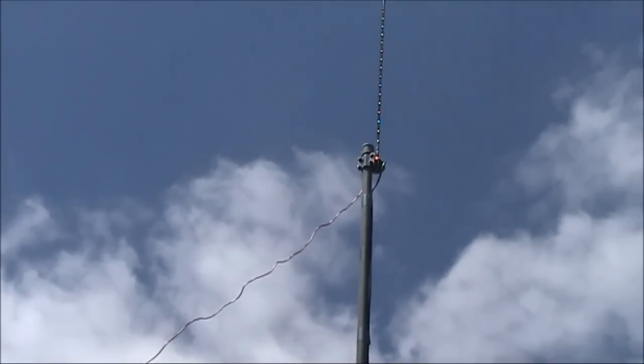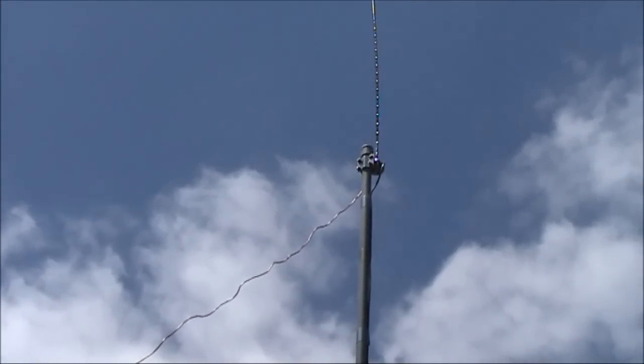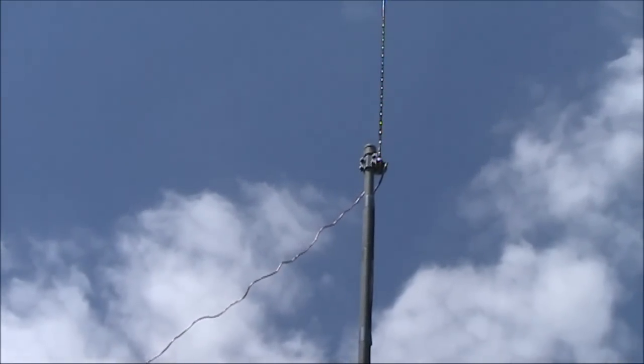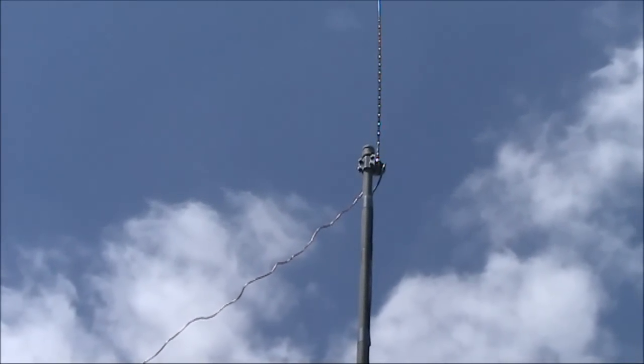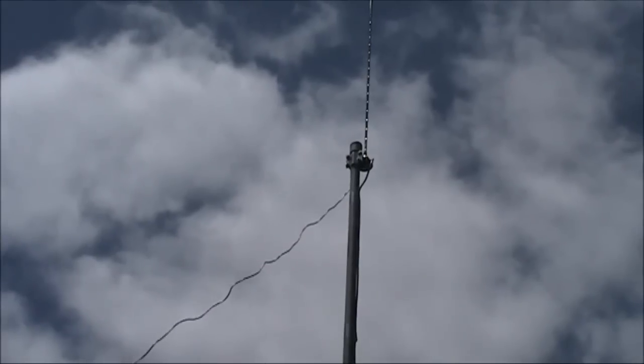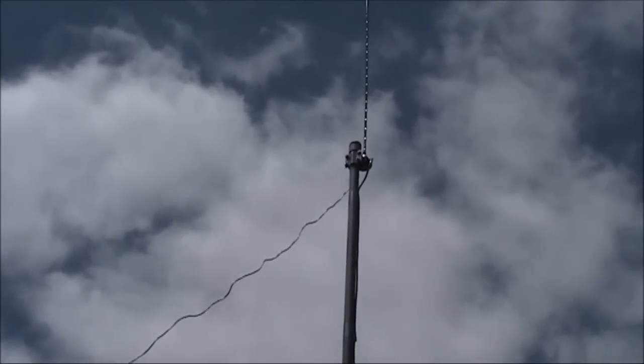This type of antenna will permit local communication up to around 40 or 50 kilometers, and also longer distance sporadic E, maybe 1,000 to 2,000 kilometers. 10, 20 or 30 watts will be adequate. You might work long distance DX, but conditions need to be very good.